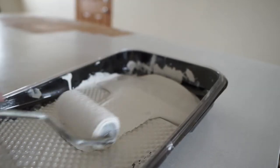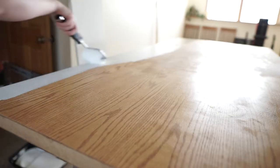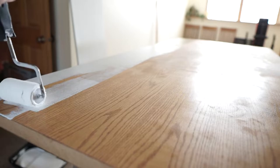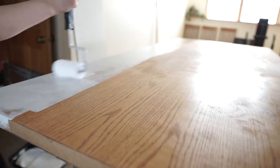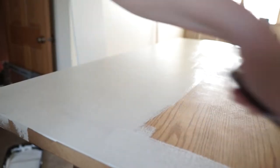For this project I'm using Dutch Boy's cabinet door and trim paint in bright white. I've worked with this paint on numerous occasions and it really does have a good application, especially when it comes to exactly what it says — cabinet door and trim paint. As long as you sand, you're going to have really great adhesion. I'm using a small roller and being conscious to paint very thin coats so I'm not going to have paint lines. You don't necessarily have to go in the same direction or with the wood grain, as long as you're being conscious of that.